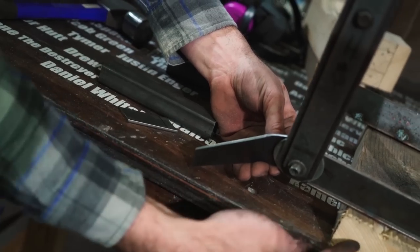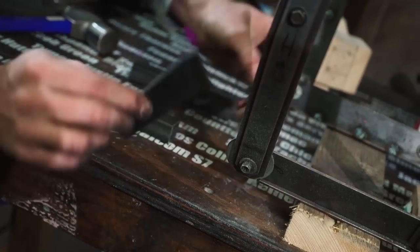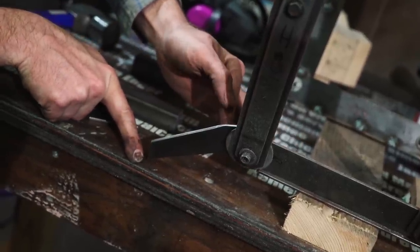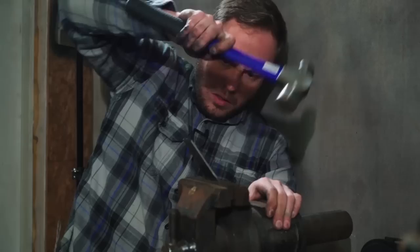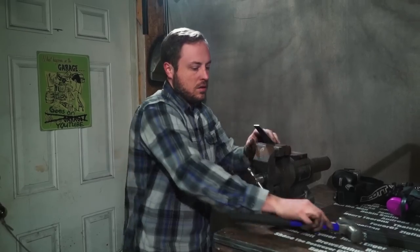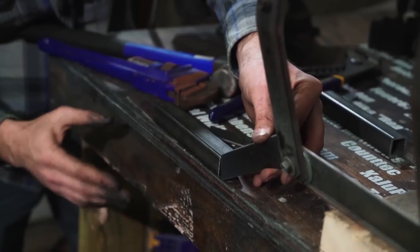Time to cut metal. The way I've got it set up it's an inch and a half off — there's an inch and a half drop, but this doesn't drop a full inch and a half because the cannon is at an angle and then it bends. So I need to bend this until it touches down on the table, giving me my drop and my angle for the rails to come forward, which is why the front part of the frame is so complicated. I'm going to call that good.